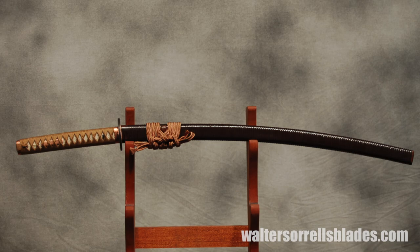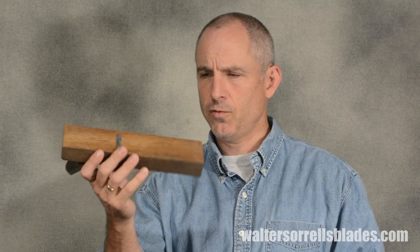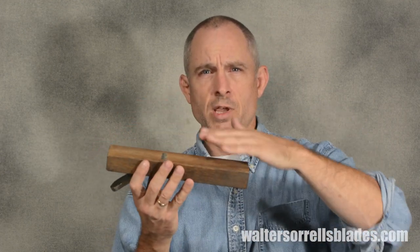Planes are also used to profile the exterior of the scabbard. It's pretty obvious how you would profile the outer portion of the curve, but if you get into a curved surface like this and try to plane it off with a conventional flat plane, it bottoms out on the corners and you can't get the blade all the way in. Basically a plane like this is intended to make things flat and it's of no use whatsoever on interior curves.